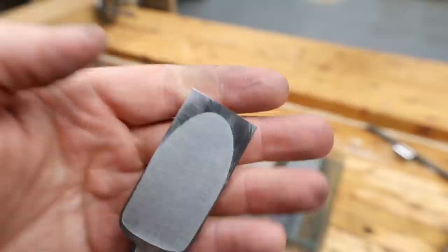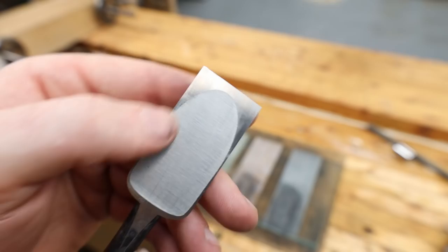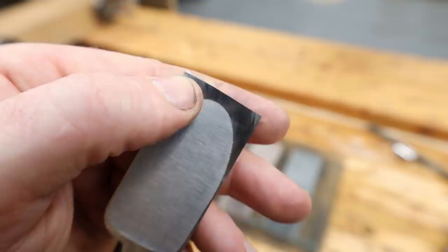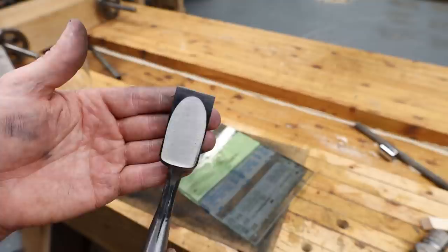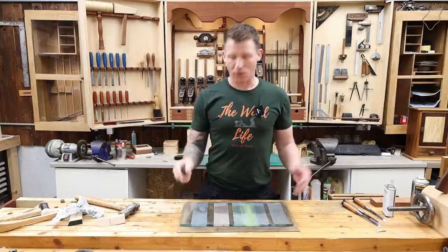You can see that small area right up in the corner behind the blade — it's not perfectly flat yet, so some more adjustment needed. It's very important to be flat edge to edge behind the cutting surface so you can reference off your material and go in nice and flat. Watch out for those tiny low spots — you can see it just shining in the corner. Almost there, then we can polish it. The back is now all flattened out to almost a mirror finish.